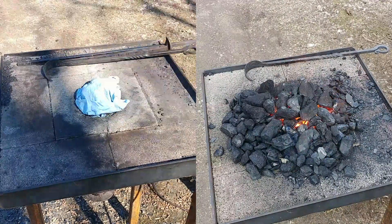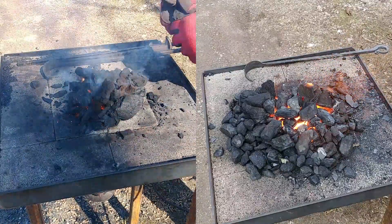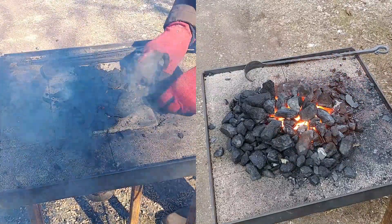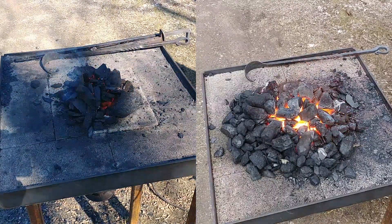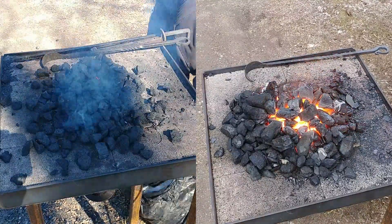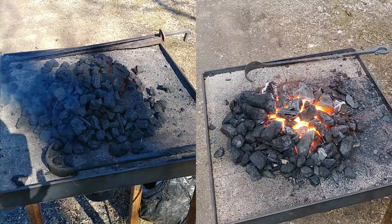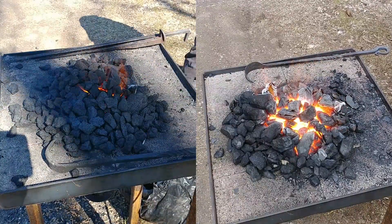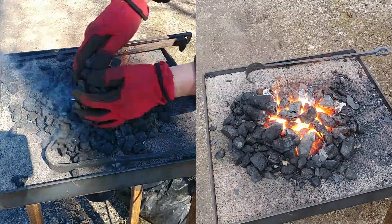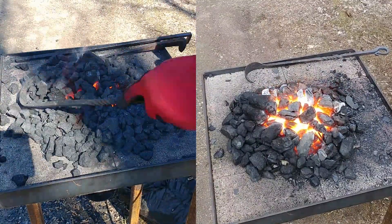This should be a very interesting comparison and you will see a lot of similarities, although they are completely different in as far as their burning capabilities. Coke is something that we aim to forge with, whereas anthracite does not coke. Anthracite does not put off a coke, it just kind of turns rock hard. It does eventually break down, but it does not get that porous nature like metallurgical grade coke.